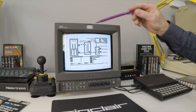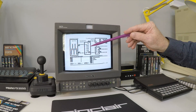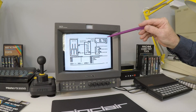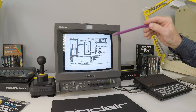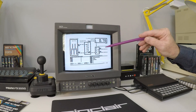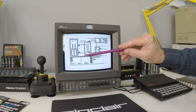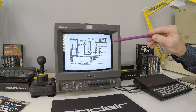What we have here is a ZX81 providing a reasonable, albeit simplified, model of a nuclear power plant. We have a reactor, a steam generator powering a turbine generating at the moment 0.75 gigawatts. This is a one gigawatt power plant, so it's running at 75% normal power. We also have a condenser, and down here we have details of reactivity and temperatures - I'll show how these components interact in a minute.